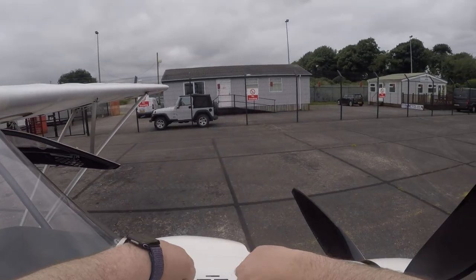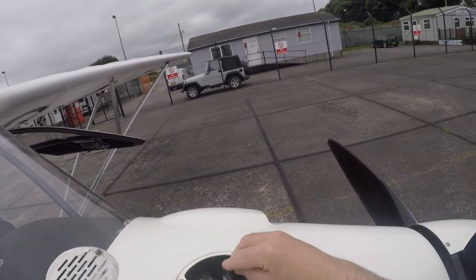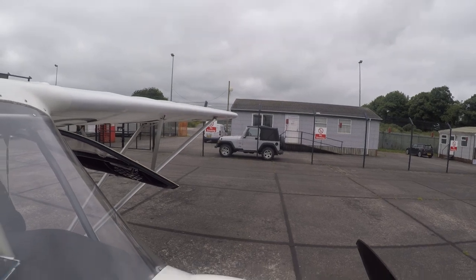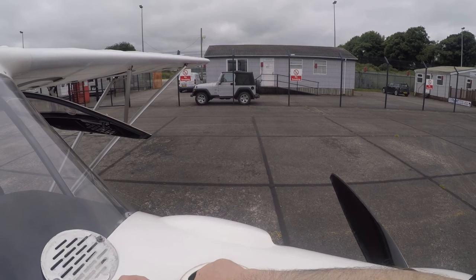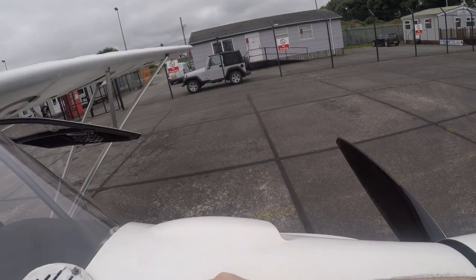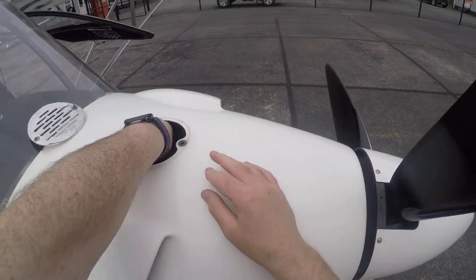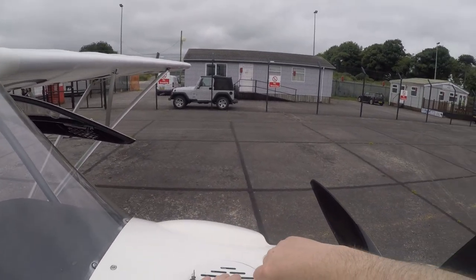For water, the first time in the morning you can check it because it's not too hot. Move the panel — it's just a little bit like a car radiator, but you only check it in the morning. Check that there's actually fluid up to the rim — and there is. Make sure that the cap is completely secure again, it's a little bit fiddly, but make sure it's put on securely.